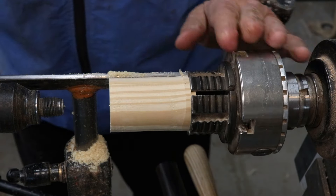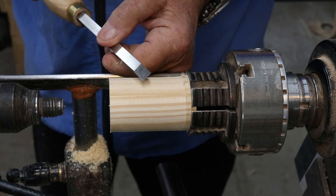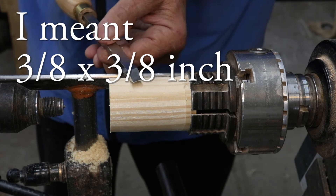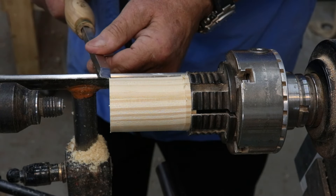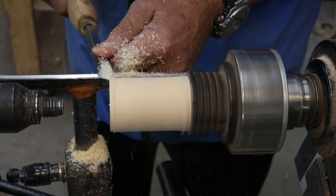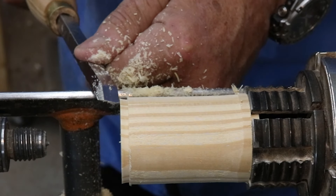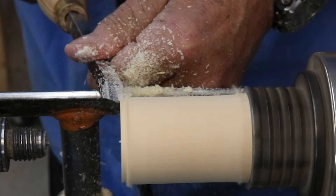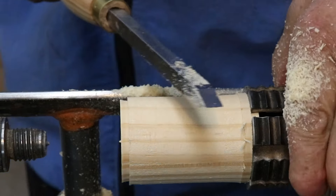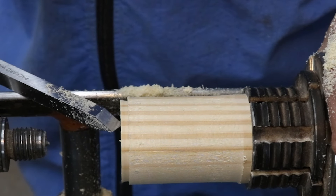I need to show you one more thing before moving on from spindle tools — this is a beading and parting tool. Ordinarily these are three quarters of an inch wide, and it looks like the same dimension tall. I often use this for forming a tenon — you just twist the tool on a side at an angle and form the tenon. This is another tool you shouldn't use in end grain. This is spindle turning — side grain — I'm cutting across the grain, not into end grain. That's going to be a problem.